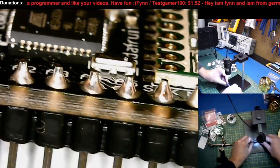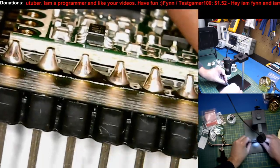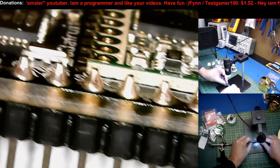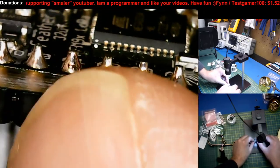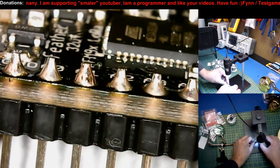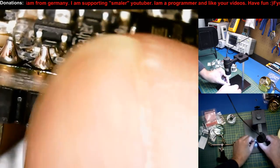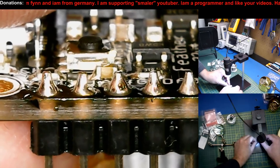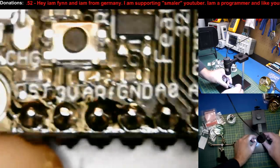That's what you're aiming for — joints that look like this. I see so many soldering tutorials on YouTube and I'm not proclaiming to be any expert, but I can tell you those are pretty respectable. That one — see the volcano look? That indicates it didn't have quite as much heat as the ones on either side and didn't quite flow in perfectly. But there's definitely nothing wrong with that — it's totally acceptable. What you're aiming for is nice and shiny.